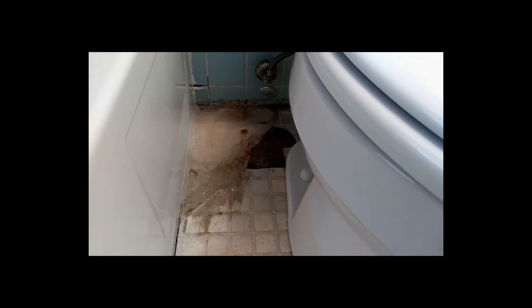One of the issues my bathroom has is one of the previous owners tried to DIY something here and just made a mess of this back area. I think there was a leak at one time and they tried to fix the floor after something happened, and it's just a mess. As a result it's not smooth, so I'm going to have to smooth this out before I can even think about putting down my flooring. The other area I'm going to have to prep — basically sand down — is the countertop next to the toilet. From years of things getting splashed on it, it's caused the paint to crack and peel. So when I paint this I'm also going to put over a coat of polyurethane sealer to make sure I can wipe it off easily.